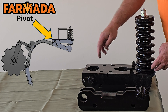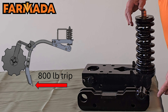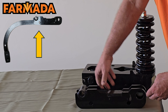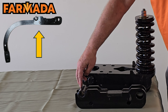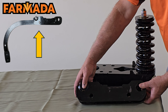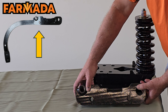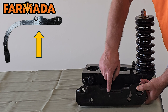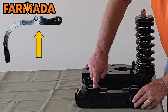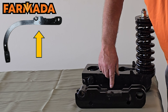I want to show you the piece at the heart of all of this — the pivot point piece in the back. The grease point is here, and then there's the pin where the bolt goes up through the top. This piece is made of two half-inch plates welded together. We jigsaw-puzzle this together, integrating the pieces so we can get a good weld that spreads stress out over the piece, making it significantly stronger through that jigsaw welding design.